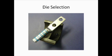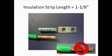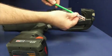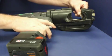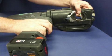The installation of the number 6 AWG lug is similar to that of the number 2 AWG lug. Begin by selecting the blue die to match the blue marking on the lug — Panduit part number LCC6-14AW-L. Install the dies in the tool; they are interchangeable and may be installed on either side. Strip an inch and an eighth of insulation off the end of the 6 AWG cable so that the wire can be inserted all the way to the bottom of the lug's barrel — be careful not to nick the conductor strands. Insert the conductor into the barrel until it stops, orient the lug tongue as before, put one crimp on the part, and release it after the tool cycles fully. The connector installation is now complete.